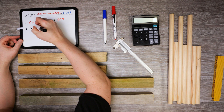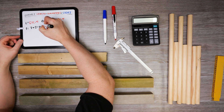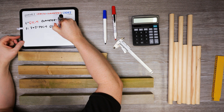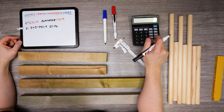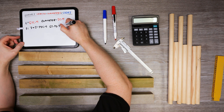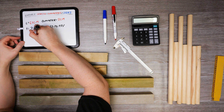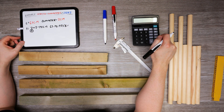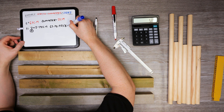First, I'll try to see what the spacing ends up with if I were to add 7 dowels. Seven holes will have a diameter of 14 centimeters. Deducting 14 from 61 leaves 47 centimeters. Dividing 47 by the number of sides — which is 8 — gives 5.8 centimeters spacing between the dowels, which is way too little. Therefore, fewer dowels are needed.